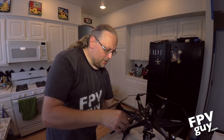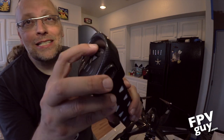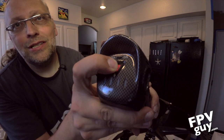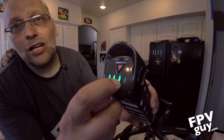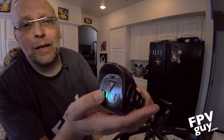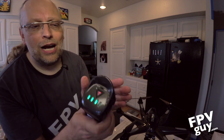So now, the last thing to mention here probably is the on button here, and then we get a little bit of a red glow. Now when I push this, you see this blinking here? In about five minutes of flight, it's going to move to three and the last one will be blinking. Another five minutes later, it will go down to two and the number two will be blinking. And finally, when you have only one blinking, you've got about five minutes of flight left. So this is an easy way, if you have many batteries, to pull out batteries and see how much flight time you have. There's basically about five minutes per bar.